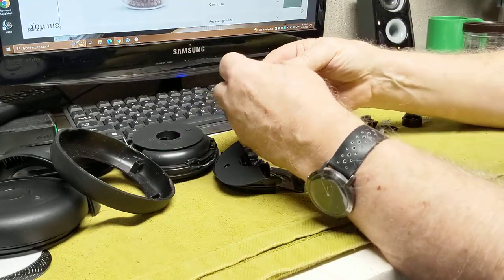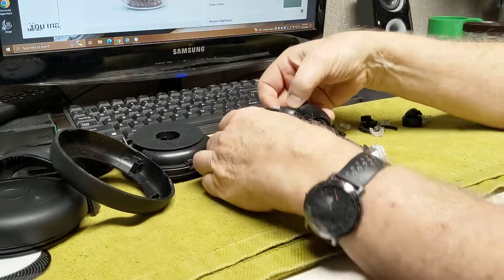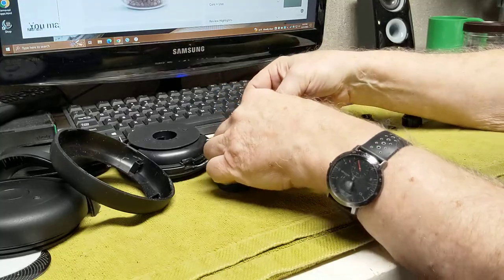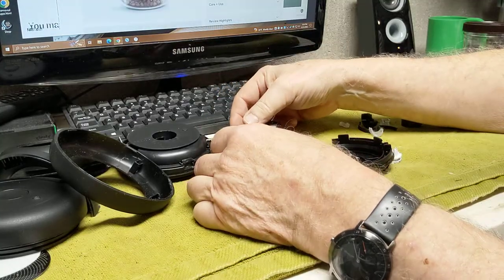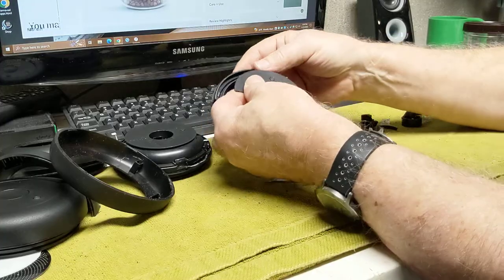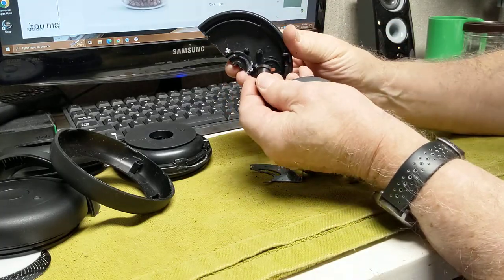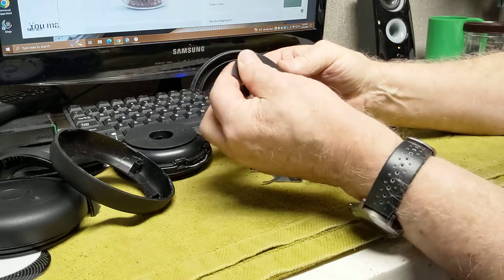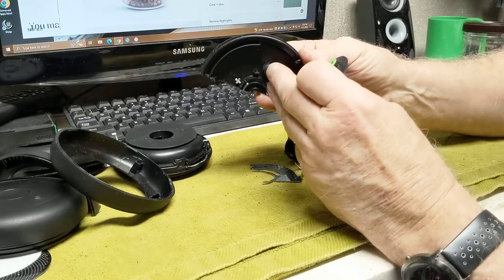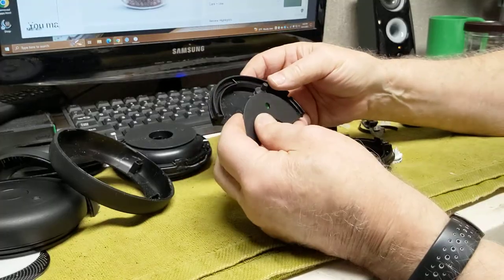This is the full part — it's sealed on the other end, and it fits down on top of this keyhole right here. That's where it pulls the vacuum out, so that's a pretty simple part. When you create the vacuum, there's a little rubber piece that slips on a little peg right here. Inside it's green, and when this gets pulled down, this little rubber piece gets pulled down and shows the green part — indicating that there is a vacuum.